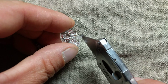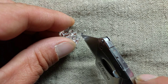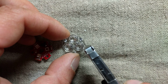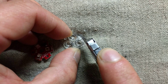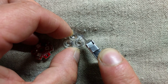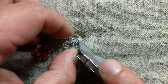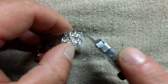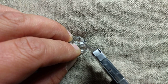When you do it, take it and set the edge of the blade right on the little lip. You can feel on the edge of all these legs they're indented so that it can fit down inside of the LED star. Square off your lens, put the blade just against the edge of that lip, and you can shave down the inside of the leg a little bit, just removing a little bit of material from it. Be very gentle, be very slow - you don't want to crack the leg of the lens, you just want to clean off a little bit of that plastic. This way you're not fighting to fit a file down inside of that space, and you're not getting little tiny shavings or dust or anything else getting inside the lenses.